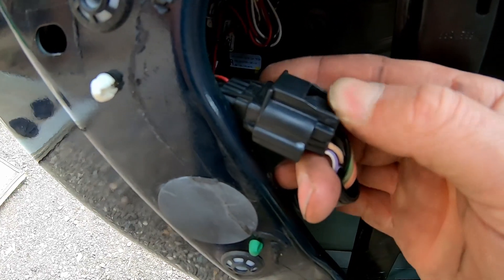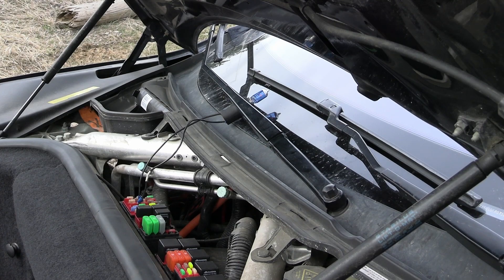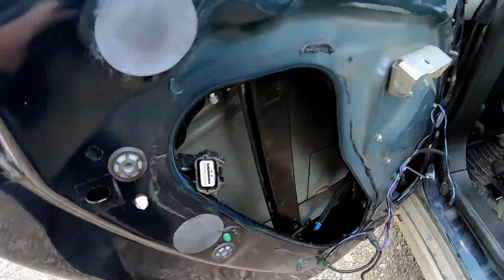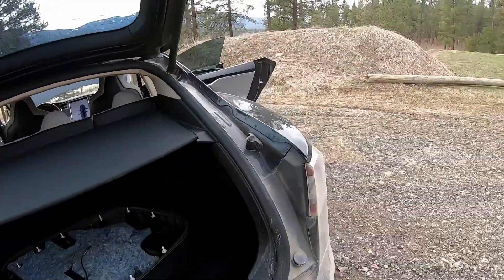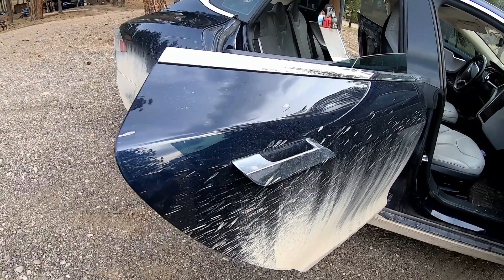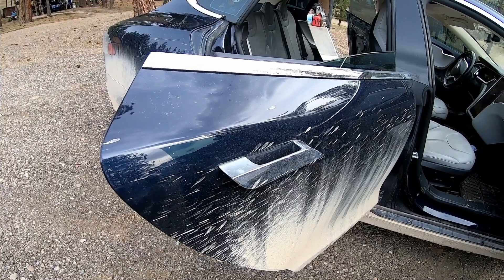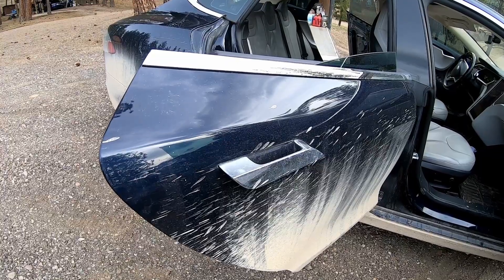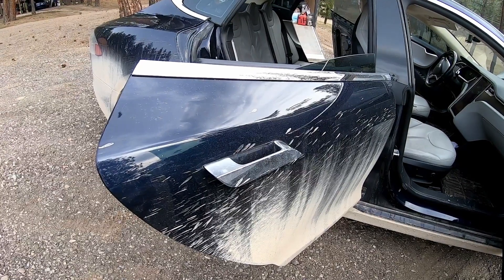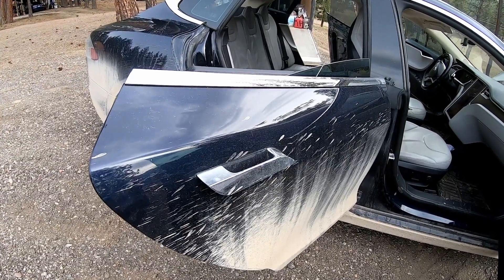I'll probably need both hands for this. Let's see if the light goes off. Plug is apart — and what happened? The light went off immediately! What else happened? Let's go over to the other side here because I heard something — and this extended! Why could this extend now? Because the light bulb is in there and it acts as a conductor, so power can flow through the light bulb. Since this side here is working fine, this will just come out. The light bulb is just like the fuse would be in there, but in case we have a short, it doesn't blow — it just comes on and lights up.